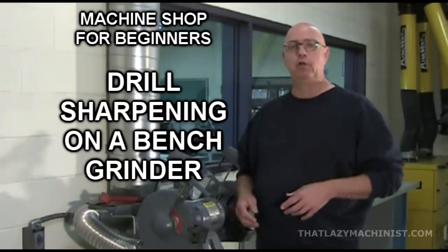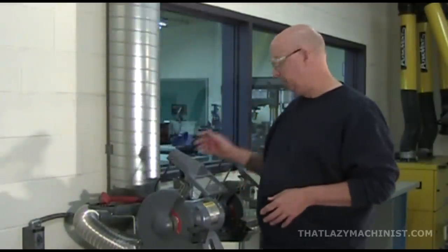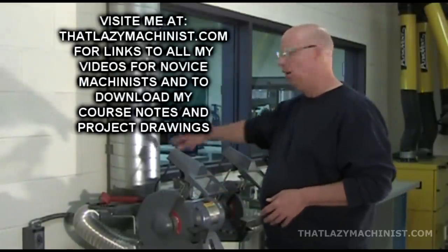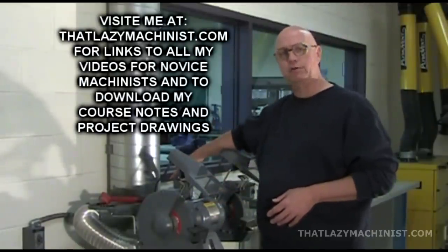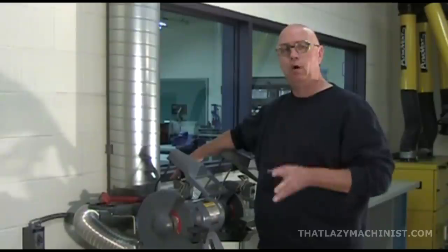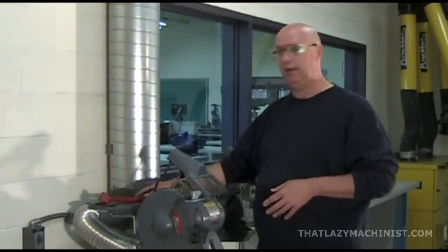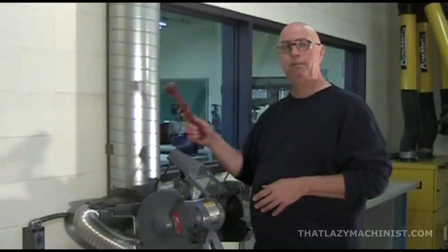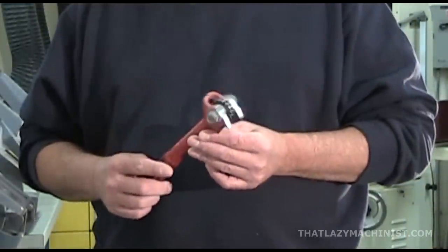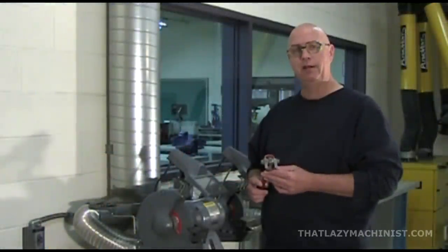Manually sharpening a drill requires certain basic equipment. To start with, you need a good and well-balanced pedestal grinder. A water container placed close by, because you're going to have to cool down the tool regularly while you're grinding it. You want the pedestal grinder and its grinding wheels to be particularly sharp, so you're going to want to have a Desmond dresser and dress the wheel every now and then to keep it cutting properly.